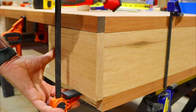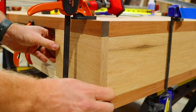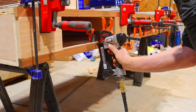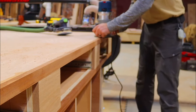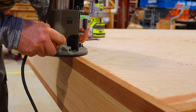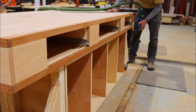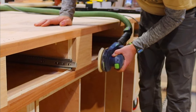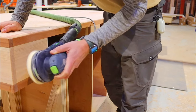I went to my hardwood dealer, picked up some Sapele, and went to my big box store and picked up some project red oak, then made myself a face frame piece by piece. I measured each piece individually, glued it on using Titebond 3, and used clamps and pin nails till the glue set up. I let the Titebond set up for about 30 to 45 minutes, then popped the clamps and grabbed my router. I put a quarter-inch chamfer bit into it and routed all the outside edges just to soften them. I then grabbed my random orbit sander with 120 grit and knocked down any pin nails still standing proud of the wood.